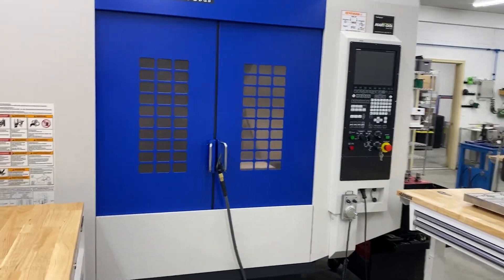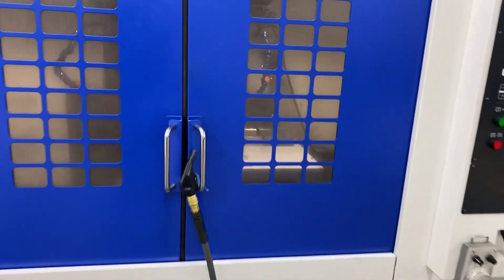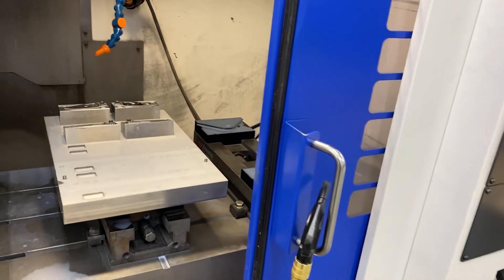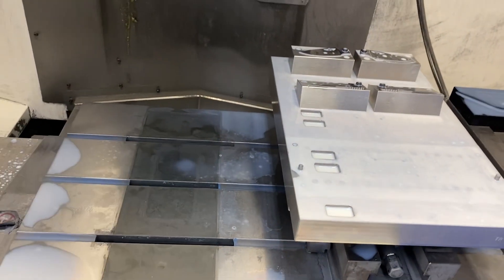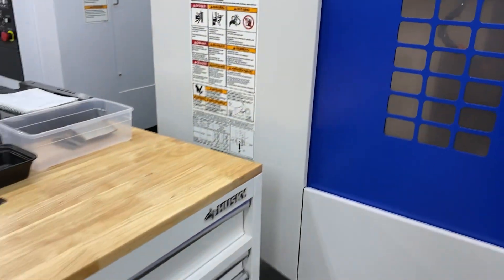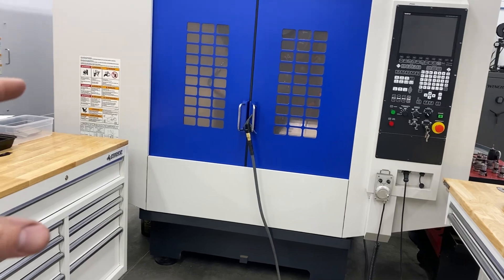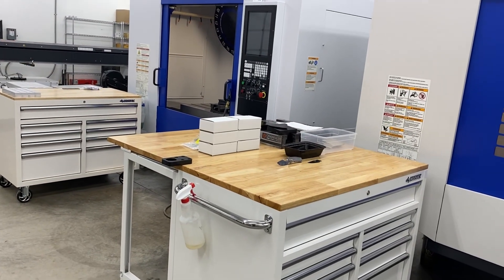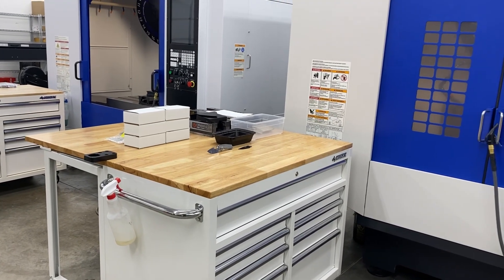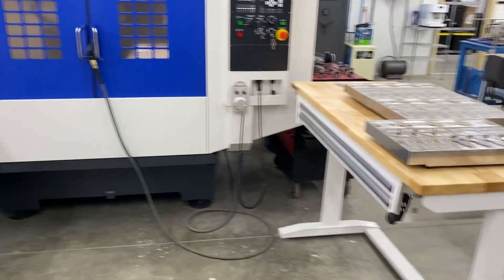This is the old S1000 — the last video I put on YouTube was unboxing this thing. It's run perfectly every single day, all day and usually into the evening, with no issues. We robbed one device off of it to get onto the other one. Once we're all set up with both machines in full production, this one will be dedicated to grinding the bevels, and the new one will do all the titanium parts — the clips, backspacers, and handles. We have the exact same tools in both machines and the same programs, so we can share workload if needed.